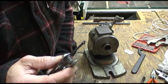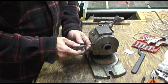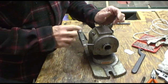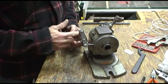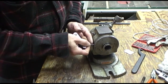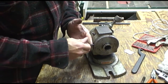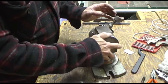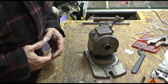Here's how locking set screws work. The locking set screw goes on, then the set screw goes on — you screw it in, all the way in. If it binds up a little bit, you have to back off to make sure that the threads line up. Eventually you get to tighten the set screw. Now you pull your Allen key out and you turn in the locking set screw. If you don't know it's there, you think you loosened the set screw, but you haven't — it causes all kinds of problems.